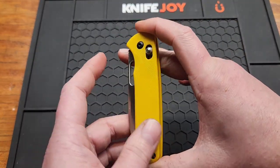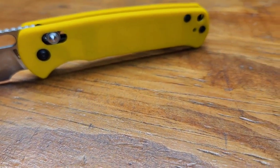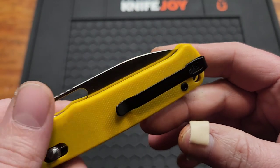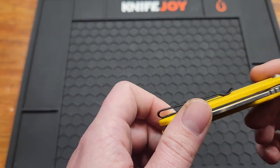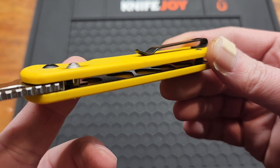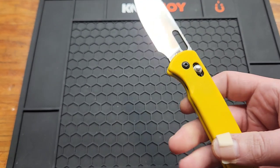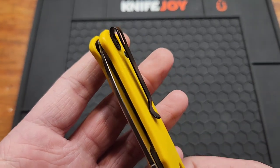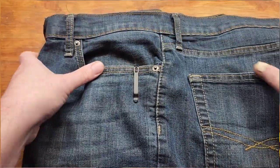You got a 4.2 inch handle, 0.43 inches wide, and the closed width in the pocket is 1.2 inches. You got T8 on your screws except for the pocket clip. Weight is 2.65 ounces. There is some weight relief on the inside — love to see that, very lightweight. You do have a deep carry reversible clip; the screws are inset but the clip is not.